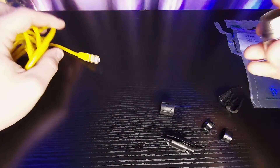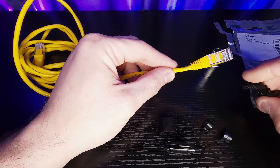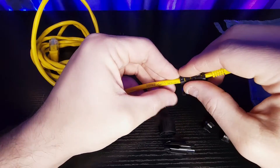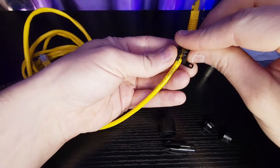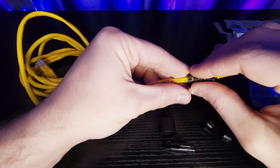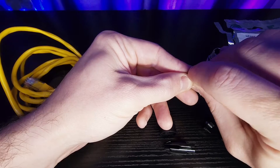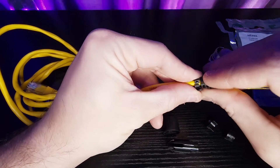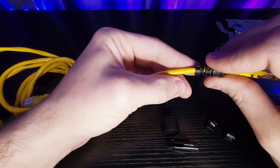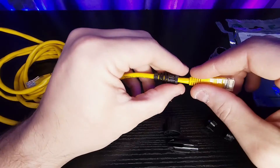We're going to go ahead and show you how to actually assemble this — it's relatively easy. Obviously, the first thing you're going to want to do is put this boot on. It's a strain relief boot for the RJ45. The one thing I hate about this kit is putting this on because it is so difficult to do, for me anyways. I don't know if you guys have problems with it or if there's some sort of a hack, but I've been making these for a while now and they're not that great connecting. But I have it on now. As you can see, that little tab right here clipped in.